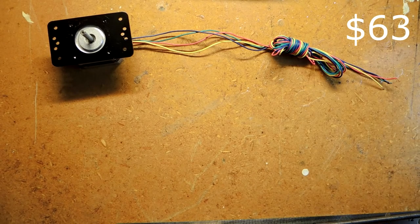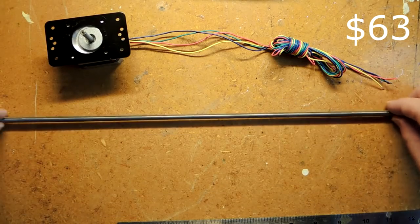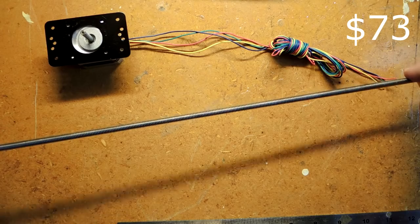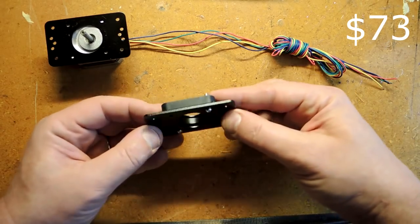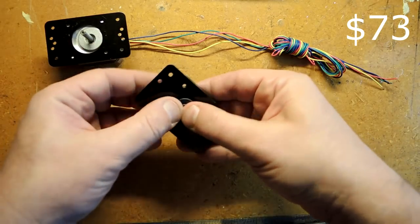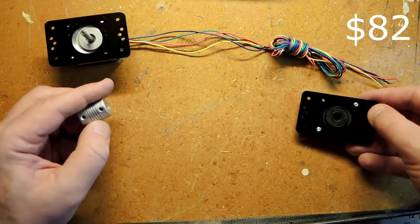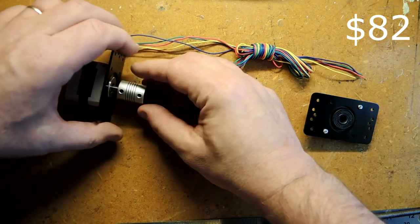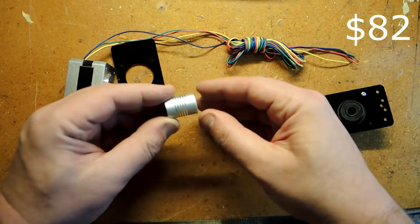I need to basically drive the platform either through a belt or through a lead screw — two possibilities: timing belts with pulleys, or a lead screw. Since I'd never done this before, I decided to start with a lead screw. This is a quarter-inch 20 rod; it costs $10, easily purchased from the hardware store. I also need to support the other side with a mount that allows a bearing to be put into it. The only other thing needed is a shaft coupler — a $5 item — which allows the rod to attach to the shaft and the shaft to attach to the motor. It has a spring-like design so the motor doesn't stall under high torque.